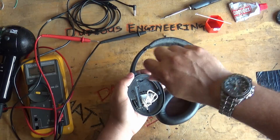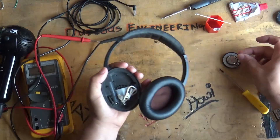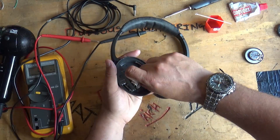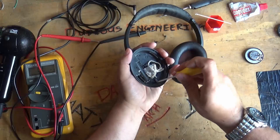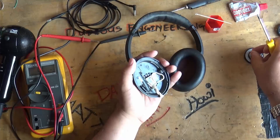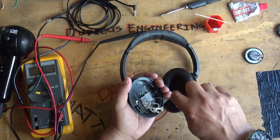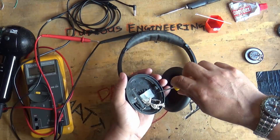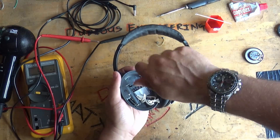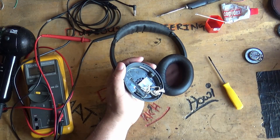There were video tutorials on YouTube showing how to fix these by putting bits of string or rolled-up pieces of paper inside — but those are only temporary fixes. They just encourage the two broken wires inside the speaker insert to reconnect briefly. It's probably not worth going down that road; you might as well just replace the speaker. I hope this video has been useful — please thumbs up, subscribe, and watch out for more technology and repair reviews from Dubious Engineering. Thanks so much for watching!